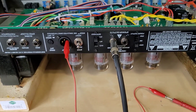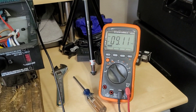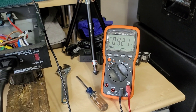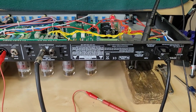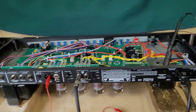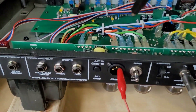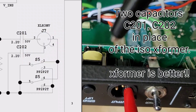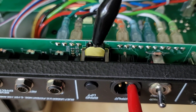I have my meter connected to pin one and chassis ground, and as you can see you're getting about a nine kilo-ohm resistance — that is not good. We want it to be zero ohms because that high impedance is actually what is causing the problem you hear. Now, according to the schematics there are no isolation transformers for this amplifier on the XLR-DI out, but that component exists. This is an isolation transformer.